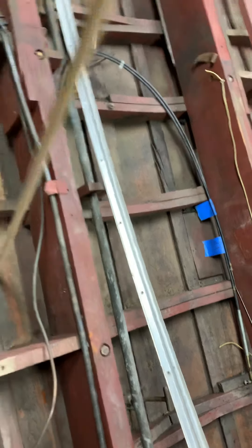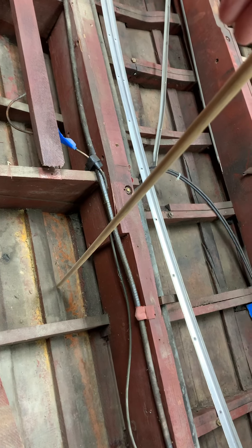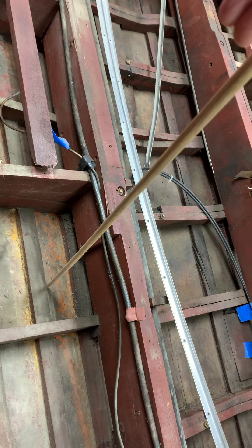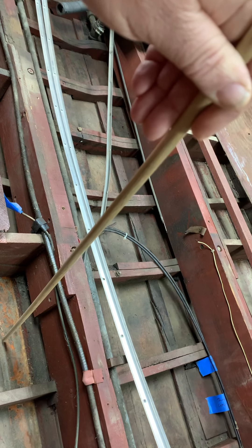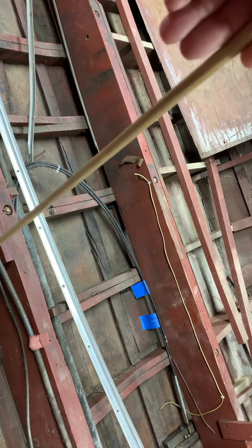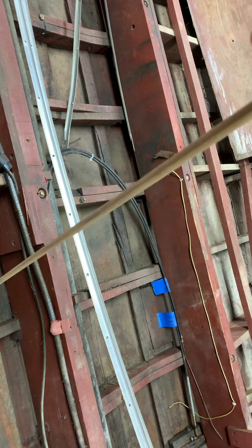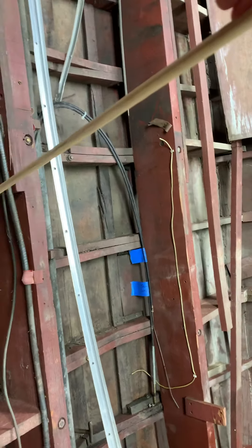Here's where the trailer did the damage to the boat. You've got half the boat behind this point and half in front, so the boat is teeter-tottering on the front edges of these bunks. Basically all the weight of the boat is being held on these two points. All the weight from here out is concentrated on the ends of these two bunks, so it's no doubt that this plank has cracked and broken through — this plank has to be replaced.